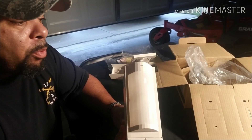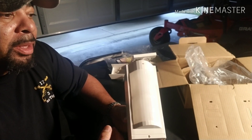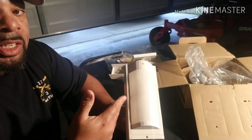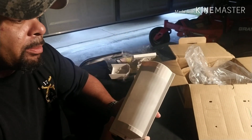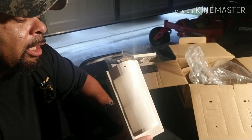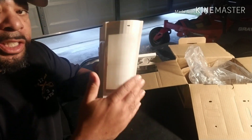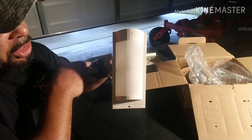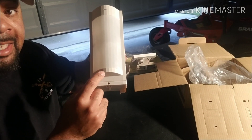A lot of these items you can get in wireless. If you purchase from an authorized dealer and you have an issue with setup, there's tech support to help walk you through setting up that item with their system, and it just works. I'm going to install this unit over the driveway, about 10 feet high — the recommended height — parallel to the ground. Since I don't want 40 feet of detection because that'll put me into the street, I've got to use the masking sheet to mask off some area inside the lens.